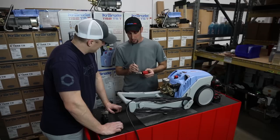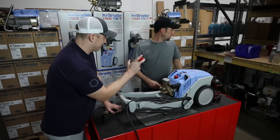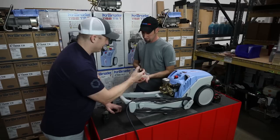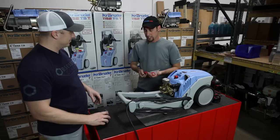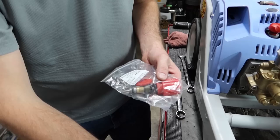The stainless steel metal stem and brass component are available without the spring and handle. You can also buy the whole assembly pre-assembled — that's what I would do. Since this machine has a pressure gauge, you can set the unloader valve relatively easily. Underneath the handle you've got a couple of bearing components to make it easy to wind open and close, then your spring, and limiting nuts that prevent the operator from going beyond the set pressure.